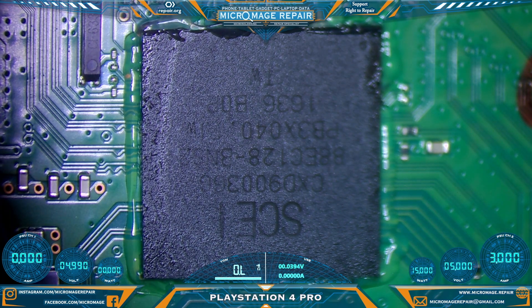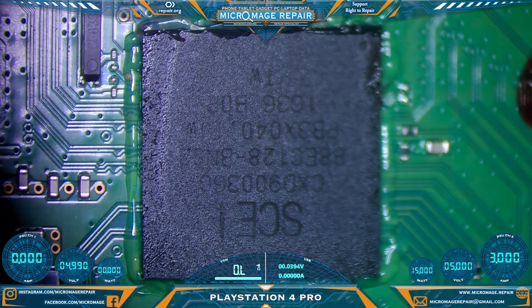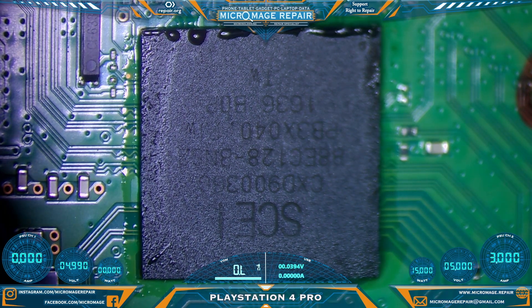So I'm going to turn this on. We're going to wait for the flux to melt. I am preheating the board at 150 degrees so it will give the whole board a nice even 150 degrees. Once the flux is melted the board is up to temperature. As you can see, the flux is melted.